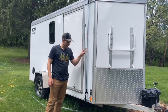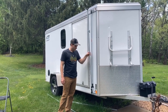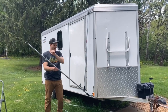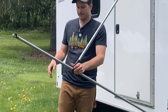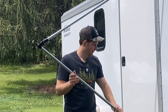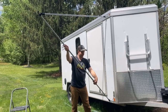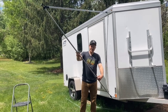I've got the first side of the awning mounted to the cargo trailer as a test to see if it works. There are two knobs: you loosen the inside one to get it to come out, and the awning comes out from the top as you do that. Then this slides out, you tighten that at the top, then loosen the knob at the bottom and it telescopes out so you can raise it up at whatever angle you want, then tighten that. Do that on both sides and it'll be set up. It looks like it's going to function pretty well.